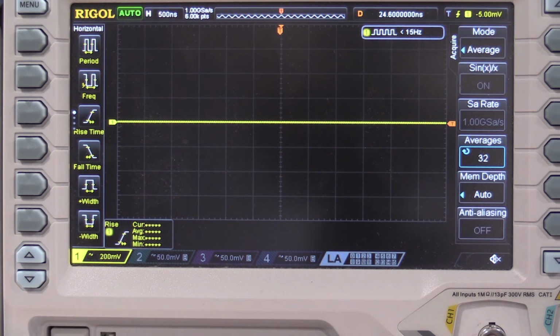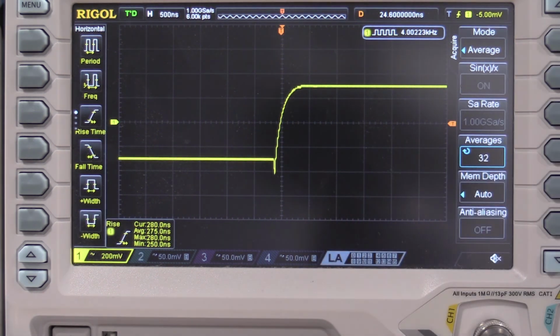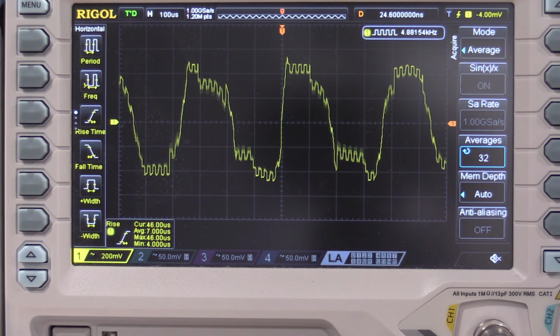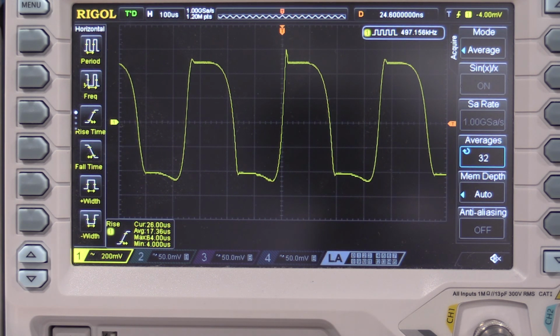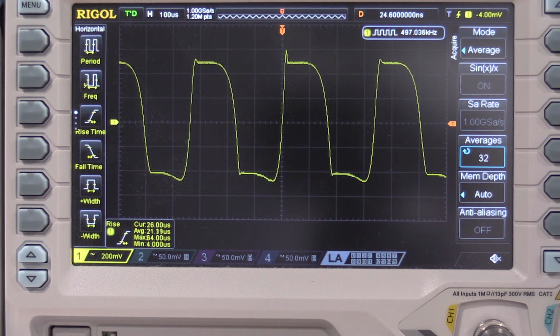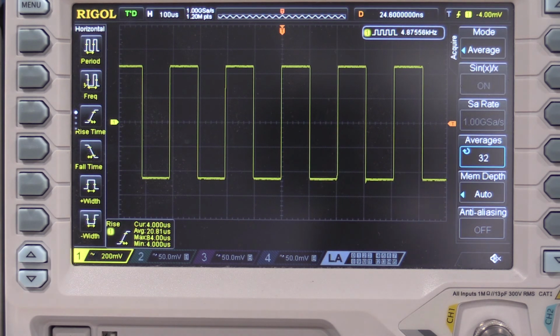try the other cable here real quick. That didn't look quite right. Maybe because it was fast. I had it set as fast as it would go. Yeah, that looks better. There's a square wave generator. The wave kind of looked a little ugly because I had it going crazy high speed. You typically don't use a 106 at 100 kilohertz. It's typically used at 1 kilohertz and 10 kilohertz, so we have a nice high amplitude square wave.